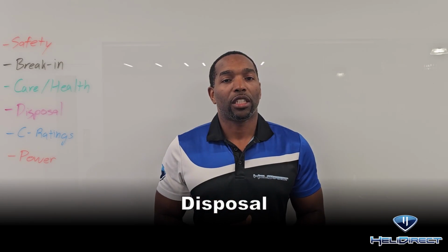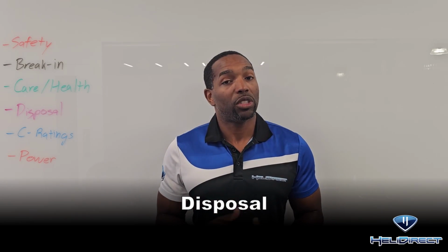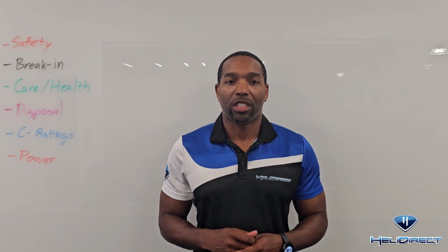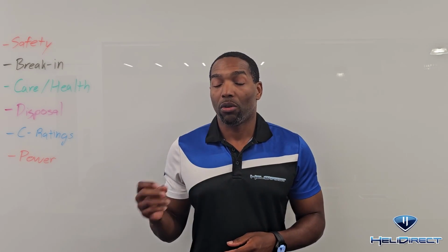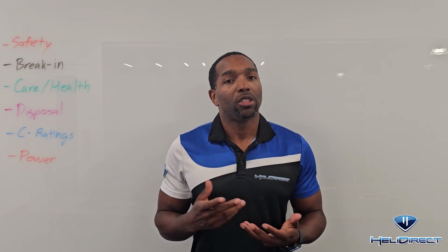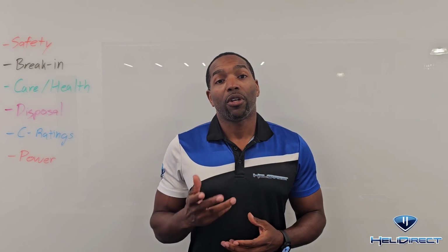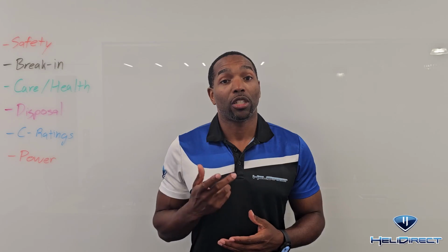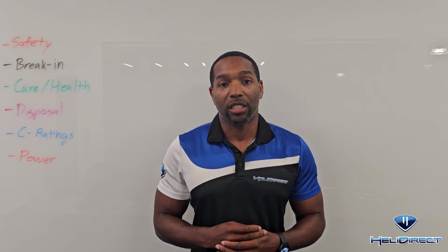So let's say it's clear that it's time to retire your battery. What's the best way to dispose of it? Now, as I mentioned before, LiPo batteries are energetic devices, and you really don't want to just throw it in the trash where it can be damaged or punctured and start a fire. So what's the best thing to do here? First, you want to discharge the battery down to 0 volts. Do this slowly and do not do it unattended.